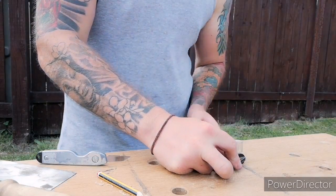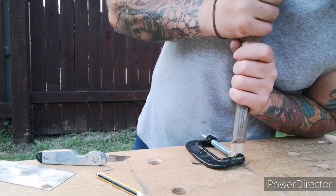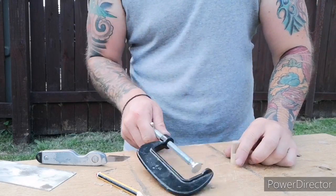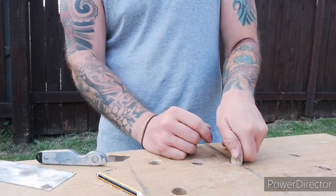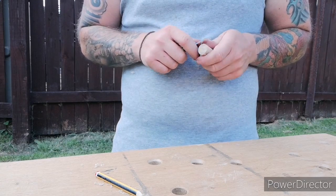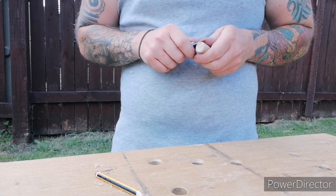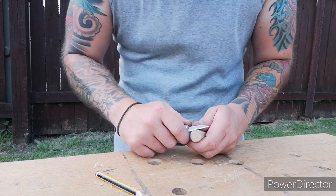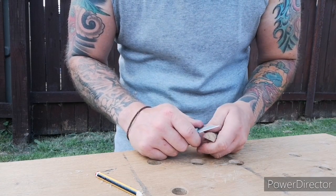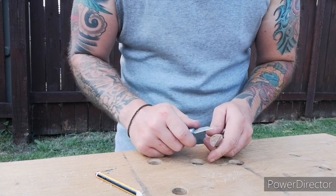Now I'm just going to remove the head portion. I've just got a little clamp here — this is just to stop the peg from going down as I use a chisel to pare down and clean the saw marks up. Then I just use my knife to create a bit of a chamfer around all the edges. I finish this off with sandpaper and give the whole thing a sanding over to remove a little bit more material. I do get quite a close fit with the sandpaper, but I still leave it a little bit tight — with wear and tear this will become loose.